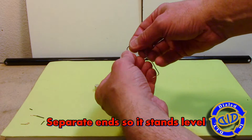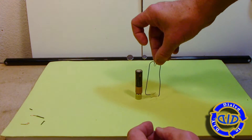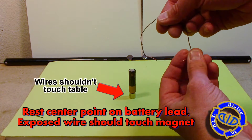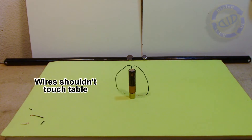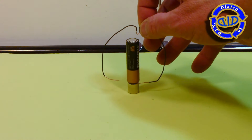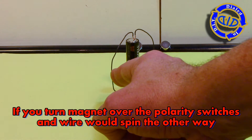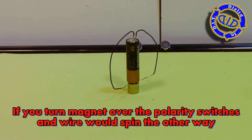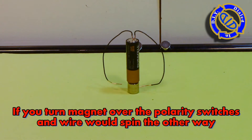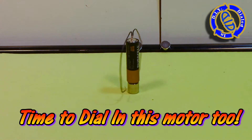When we're ready, we set this on top of our battery and magnet setup and watch it spin. The electricity running through the wire works like an electromagnet which is attracted to the permanent magnet. This setup allows you to convert electrical energy into mechanical energy — in this case spinning. The reason these two types of simple motors are called homopolar motors is because the electrical polarity does not change through the course of operation. With the two feet a little bit farther away from the magnet, the electrical current does not flow smoothly so its rotation is rather weak, but we can address that.